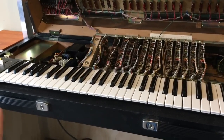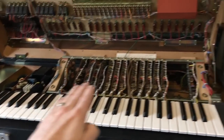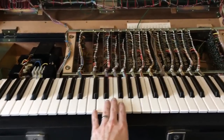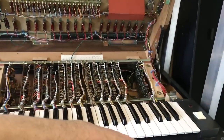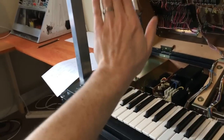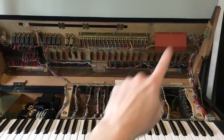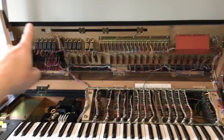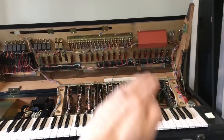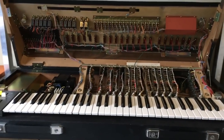The CS60 has two slopes across the keyboard to control the filter tracking. So it's not just this slope - you've also got a reverse slope. If you think of the keyboard as being split halfway, you've got a slope at the top half which could be positive or negative for the filter tracking, and a separate independent slope for the lower half which could also be positive or negative. So you could have filter tracking slopes which go from high-low-high like a smiley face, or a frowny face, or high to low or low to high, or a flat low end with a positive or negative high end - so many different options.